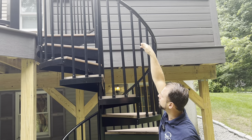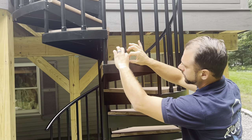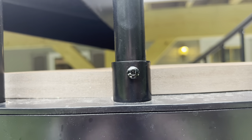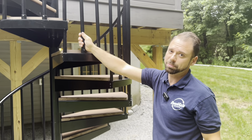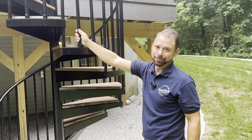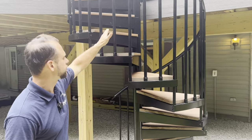From there it's your center balusters. These do get cut, but you don't cut them on an angle — you cut them down at the bottom. They also have a nut-and-bolt connection. The cool thing is if you cut them a little short, you've got a self-tapping screw that cinches everything nice and tight, so your cuts don't have to be perfect. You basically have permission to measure once and cut once.